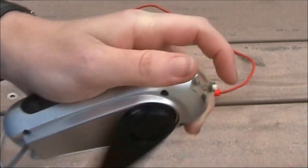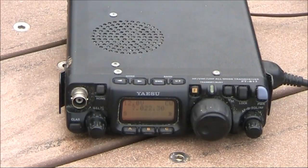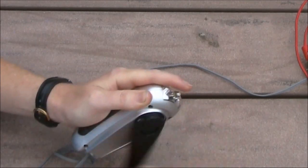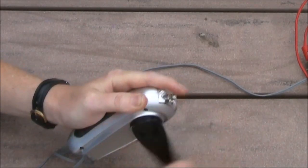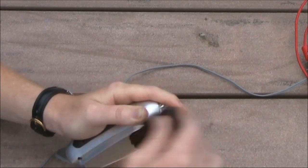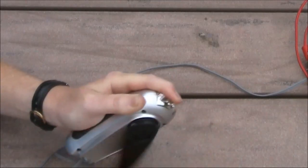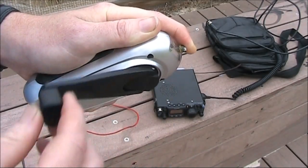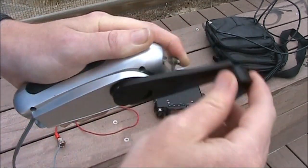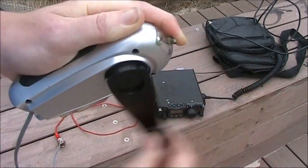Not the best of sending, but still intelligible enough. An interesting thing you notice is the more current you draw, the harder the cranking gets. When I press the key, there's definitely more resistance. Still, it's not too hard to crank and get your 500 milliwatts. Because there's no voltage regulation, there is some frequency variation depending on the speed that you're turning the handle. However, it's really not objectionable.